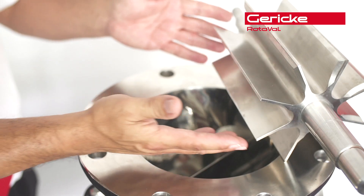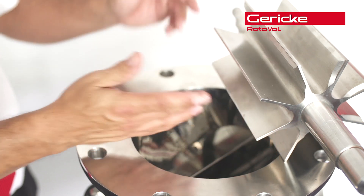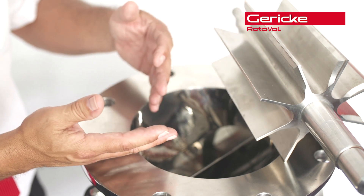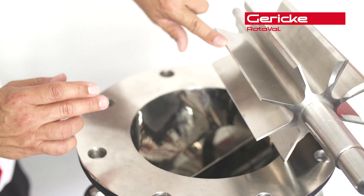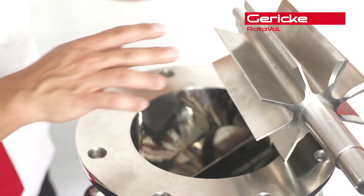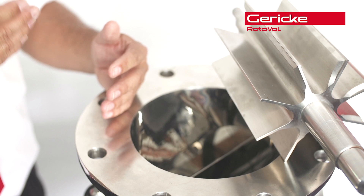To actually prevent that, you can come up with different ways, primarily in the rotor design. Rotor design can be chamfered with scallop pockets to let the product easily fall out of the pocket. We can also incorporate scraper blades that are attached here, which actually stops the product from glazing onto the bore — because, as the name suggests, scraper blades are actually scraping the actual bore and end covers.